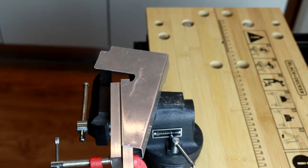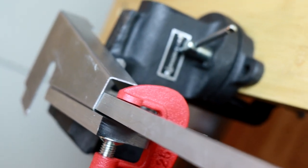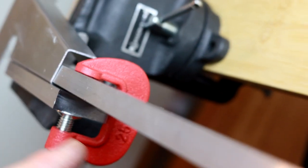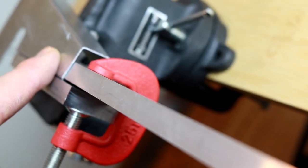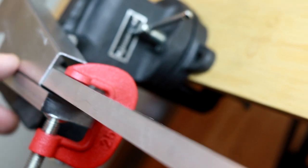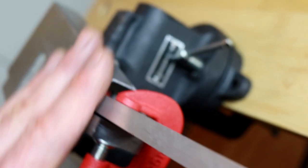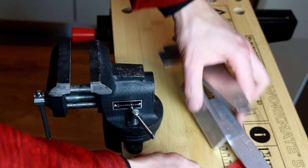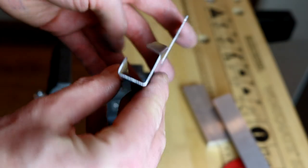Let me show you - this little corner here, this was the problem with using the table. If I had bent this one on the table, this wall would just be against the table surface. You need to do it in an order where you have enough room to hide the existing bend below the level of the new bending point. Pretty good shaping.